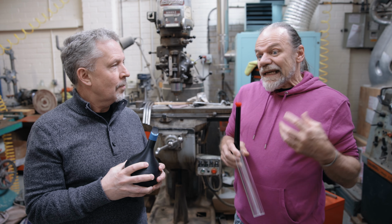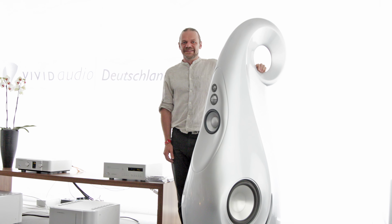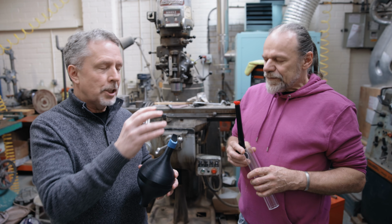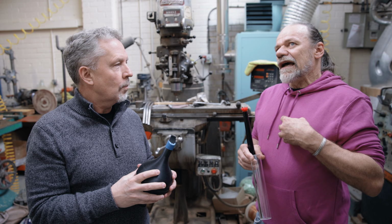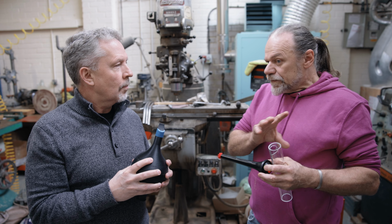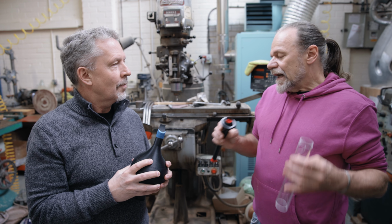But when it came to what was to be the new flagship, the G1 Gear, I was determined that we should find a way of using exponential tube absorption and bass reflex in the same... All, not just on the mid-range and tweeter. Exactly. And you could say the inventive step was to realize that with an appropriate choice of cutoff frequency, you could actually combine the two to get the best of both worlds.